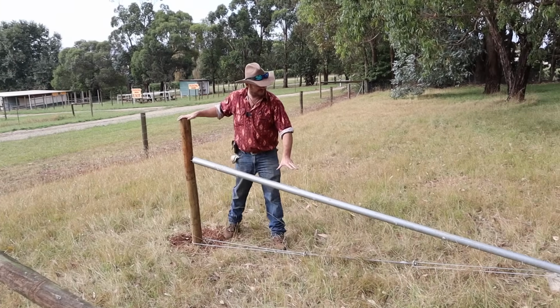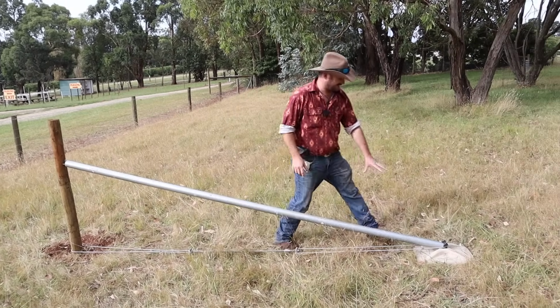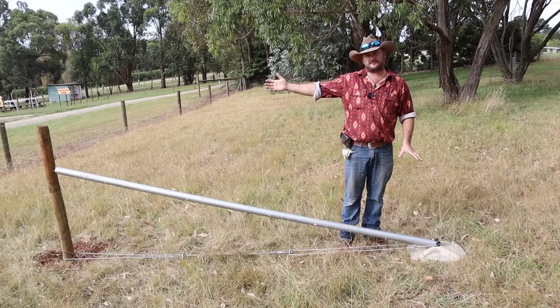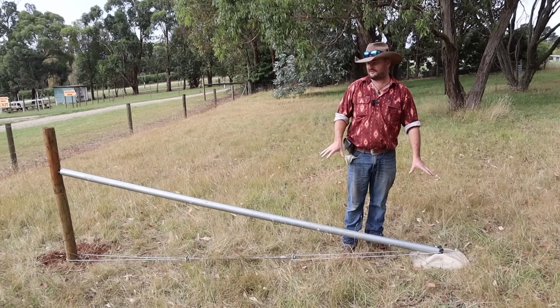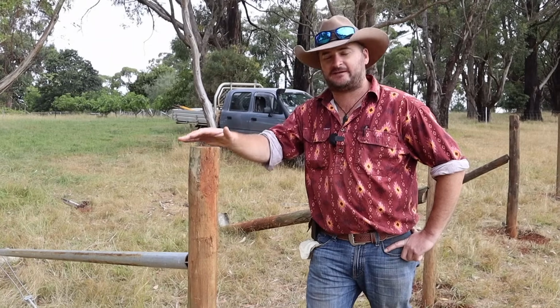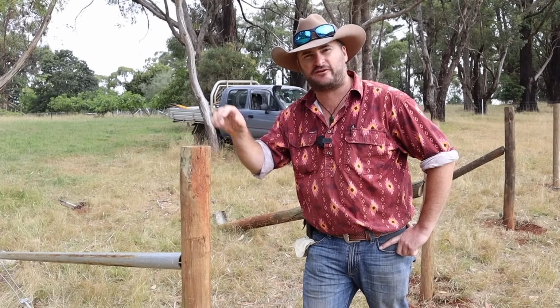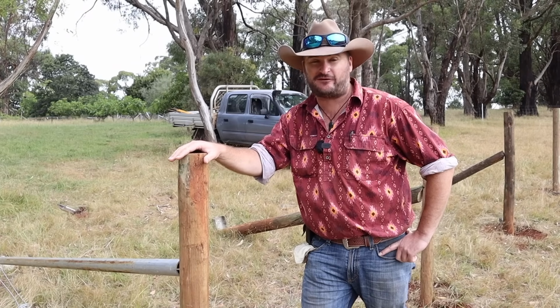Last but not least, we've got a steel tie-back assembly, and this features a floating concrete plate down at this end, and the theory being that as it comes under shock loading, it should be able to absorb a little bit of a hit and actually bounce back if the force isn't too great. I like shock load. All of these end assemblies are guaranteed to fail because we've used the thinnest post we could find. It's not in far enough. But what we're trying to find out is when and how the stay itself actually fails.